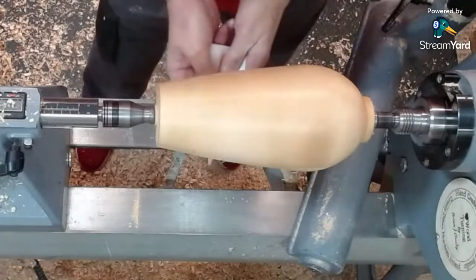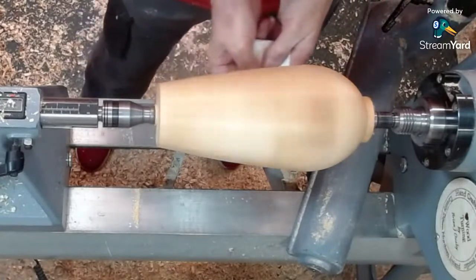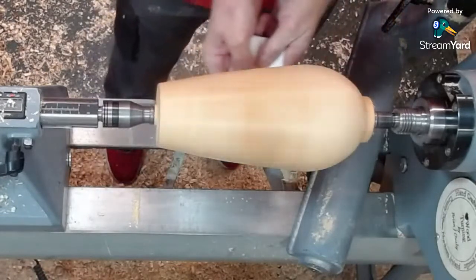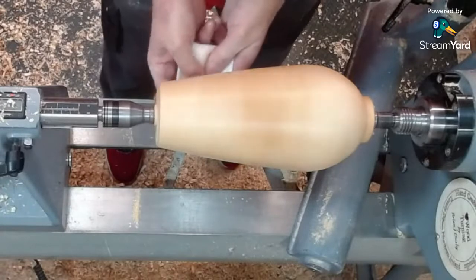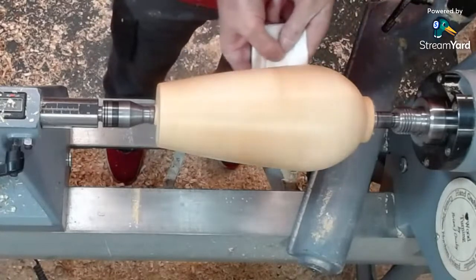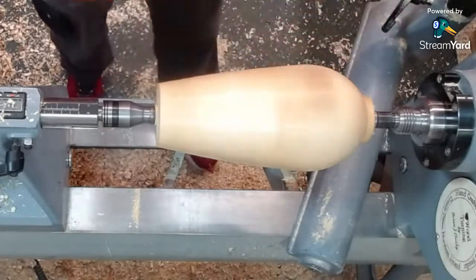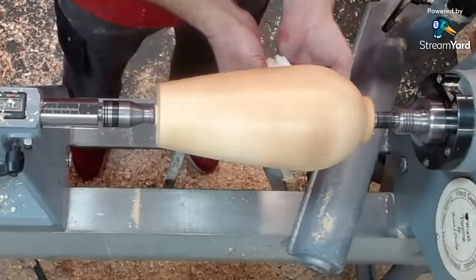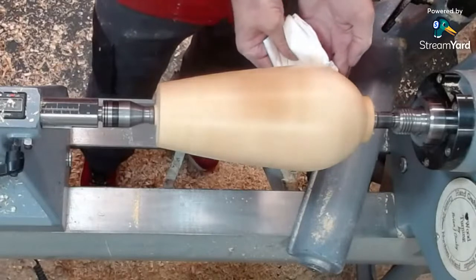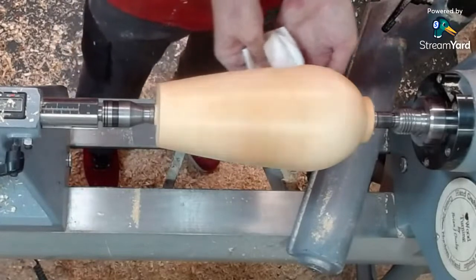Because I did play with a little one, but I got rid of it because it actually wasn't that brilliant unless it was really on where you were sanding. This one takes everything in. It's got to be quite close, right? That depends on your extractor as well. Podges, at Colwyn Way, uses a flexible aluminium tubing, which looks like it goes to an outlet of a clothes dryer. I use the same flexible Stay-fast hose, and I don't bother to put a hood on. It's expensive, but it is good for, as you say, it's very flexible. Yeah, the connection is 4 inch, Lawrence. It does what it says on the tin. Stays fast.